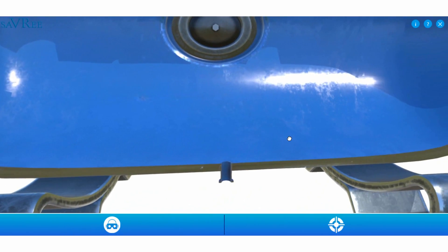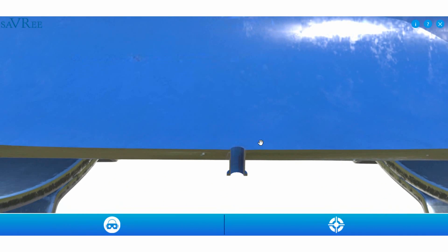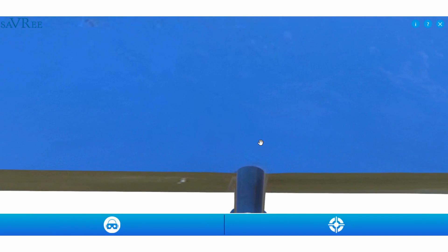Zooming to the drain, condensate is drained from the lowest point in the tank, which is where the pipe is. If we allow condensate to build up within the tank, it's very likely we'll have corrosion or pitting on the inside of the tank — on the shell — which is obviously not good.